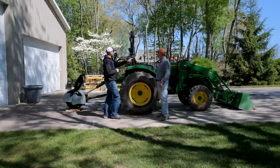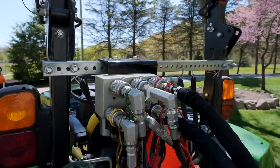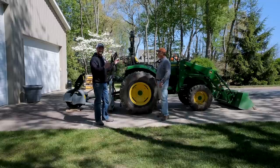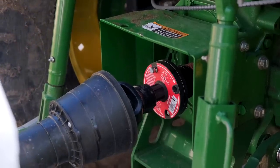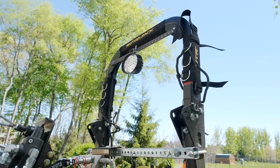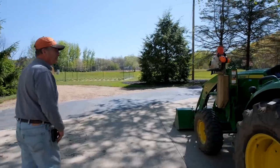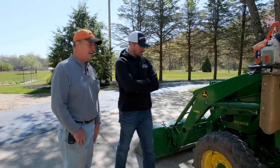Eric has added quite a few things since getting the tractor last June: a hydraulic multiplier on the back, a PTO link, a big tool rack on the ROPS bar, a light, a homemade chainsaw holder custom-routed around the ribs with just two bolts while still maintaining access to the grease zerks, and hooks onto the bucket. A lot of really cool little modifications.